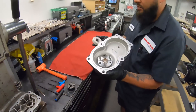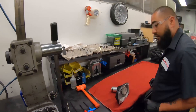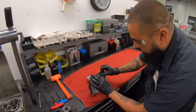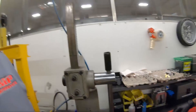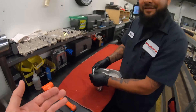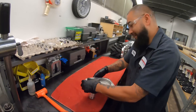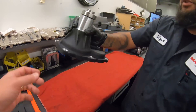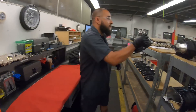Next we're going to get to the coupler part that goes on there. Is it an o-ring? Miguel, when we are doing testing and research and development and we have to pull rotors out of a supercharger housing, you do not understand how nice it is to have an o-ring. It makes the assembly process a lot easier too. It adds a tiny bit of cost on the front end to cut that o-ring groove on the machine, but anytime you're doing assembly or service later on, you don't have to use loctite or any other sealant. And this is our whole nose cover assembly - very nice. Now we'll move on to the housing process.